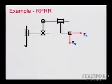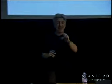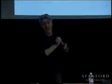So this prismatic joint actually is sliding along this axis. You see these 2 points? These are the sliders. So it moves to the left and to the right. You have a z-axis for the prismatic joint that is out of the plane. So we have only here one joint that has an axis coming out of the plane, and this one is the revolute joint. You're asking me if we have the case of a prismatic joint that is coming out of the plane. Well, that might happen, and you will see the figure. There is a way of representing that. But when we do it, we usually use a sort of 3D representation to show you how it's coming out of the plane.